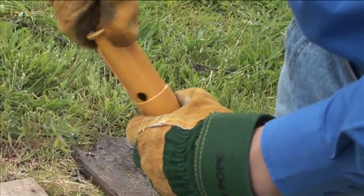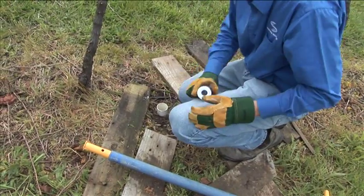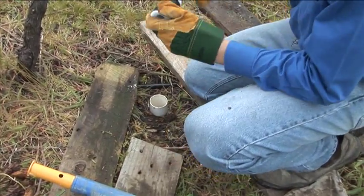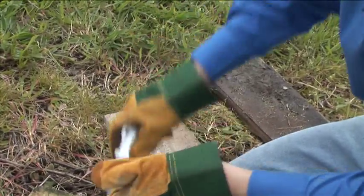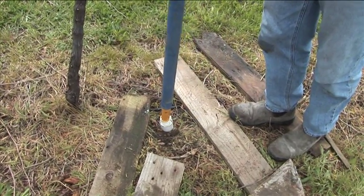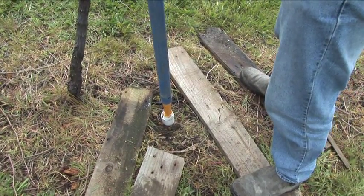Then screw the expandable bung tool onto the auger extension, tighten it up. Take the expandable bung, give it a few twists so that it grips when we first put it in the tube and doesn't fall straight down. It's just firm enough. Use the auger extension and expandable bung tool to push the bung down the tube all the way down to the bottom.